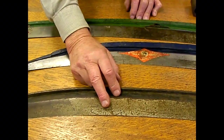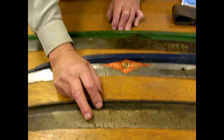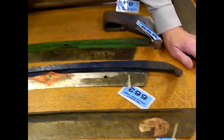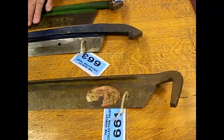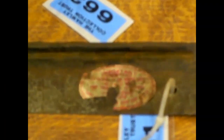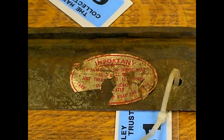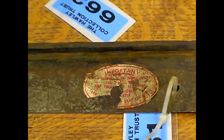These three materials were welded together under a power hammer — a water-driven power hammer — and drawn out to length and to width in order to do that job. Then they were hardened, tempered, and then ground to get a keen surface finish.